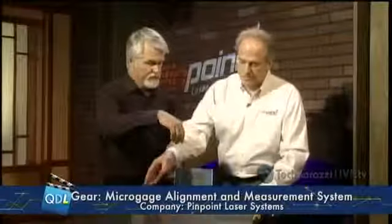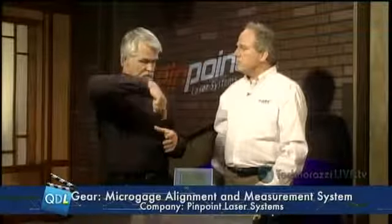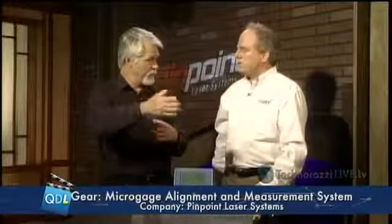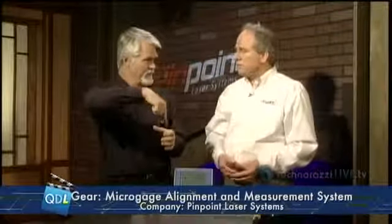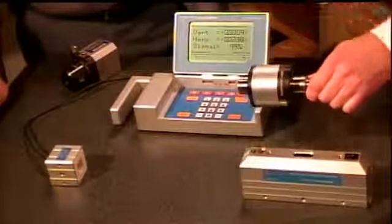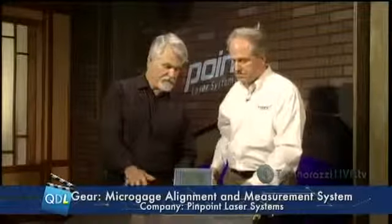So I would imagine it could also tell you whether the chuck is true perpendicularly, because you would see a wobble as it turned, right? If you were to rotate it through 360 degrees and it wasn't perfectly perpendicular to the chuck, you would expect to see that. That's exactly right. When you turn the chuck or whatever's holding this laser 180 degrees, half a turn, what you actually do is you sort of double all the errors that are in the chuck and the mounting. And when you're measuring it with a receiver that can measure down to a 10,000th of an inch, you can see everything.